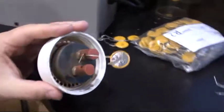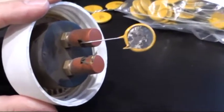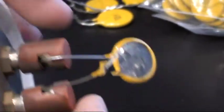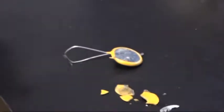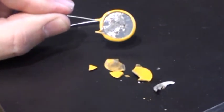As you can see, this MOV didn't hold up so well, and that's part of the reason we bring them here — to demonstrate that MOVs eventually are going to end up looking like this. Every time they do their job they get a little bit weaker, and if they're exposed to enough voltage they could blow up just like this one did and then provide no more protection.